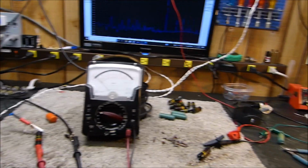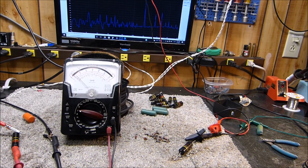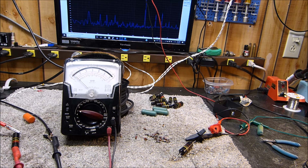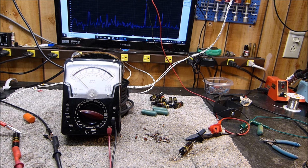Now, the last thing I want to do here is demonize bumblebee capacitors, because I've got a lot of equipment and it's full of these bumblebee capacitors, and it works very well. So be careful. The leakage in that capacitor that we just looked at is very, very small. I mean, look at it. This is on the 3-volt scale with 400 volts across that thing.